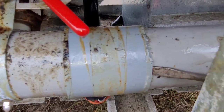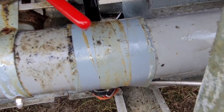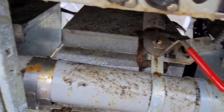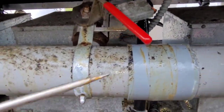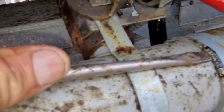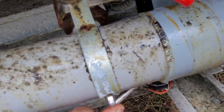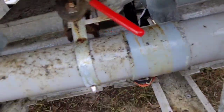Take a flat screwdriver and carefully work around it — don't nick your sleeve. It usually sticks to the pipe, so go around it like this. Do it as flat as possible all the way around so you'll be able to slide it off.